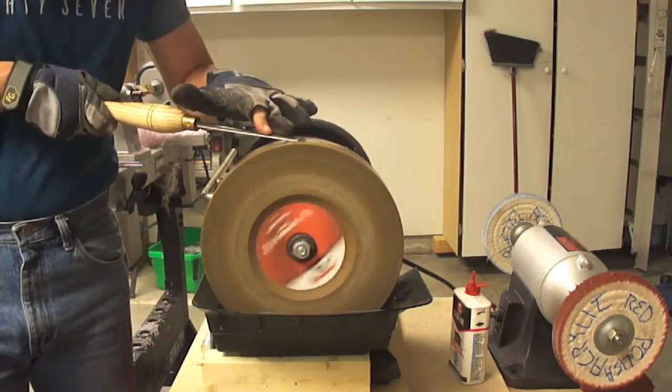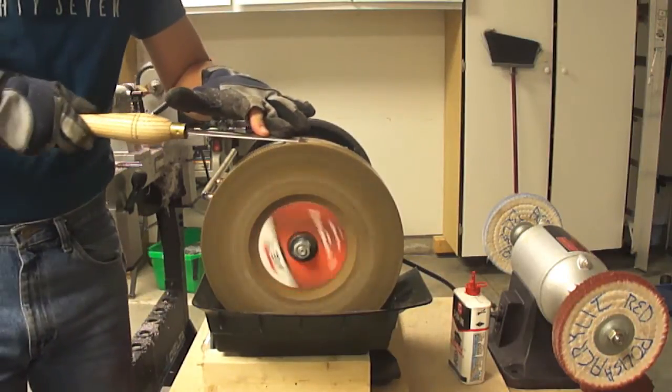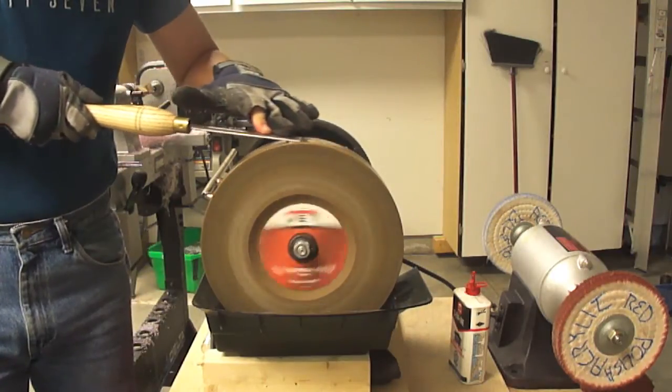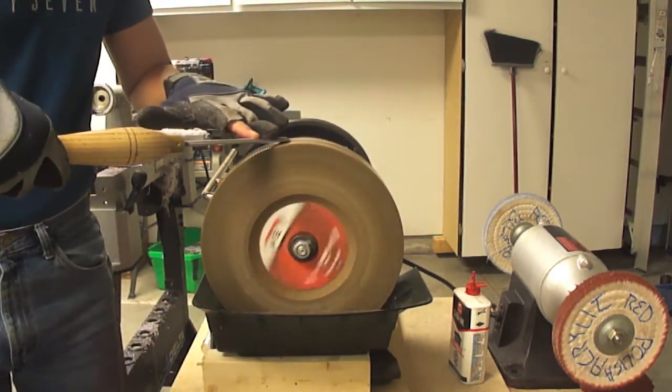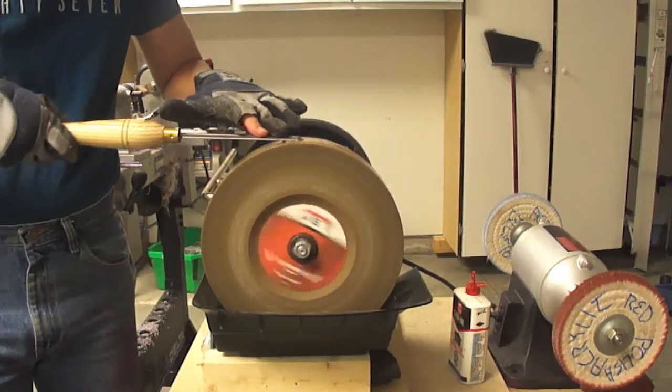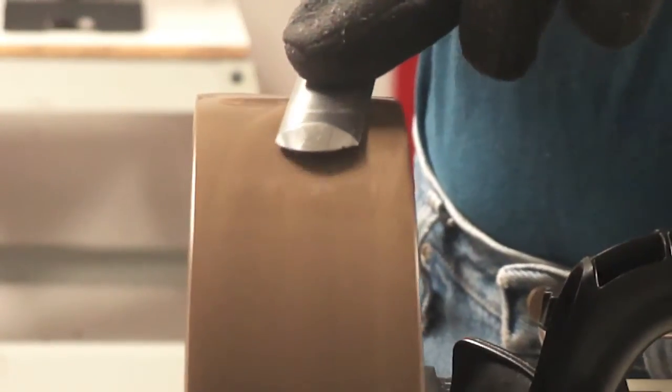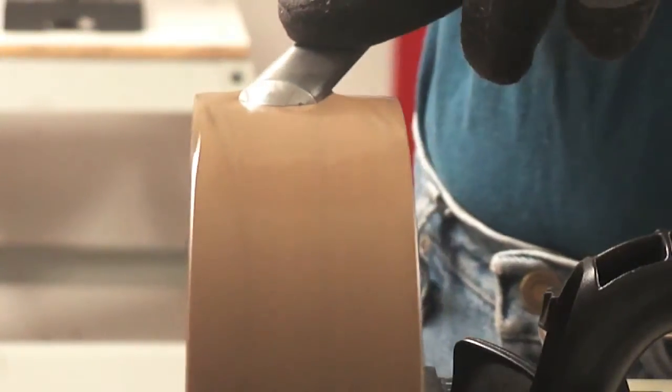For best results I use the top section of the grinding wheel. Using my left hand as a fixed point and my right hand as the moving axis, I am moving the tool from left to right so I can have a good grind on all the perimeter of the tool. The sharpening process using this method will last no more than 3 minutes. This tool does not require any special jig for the grinding process.